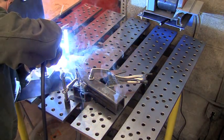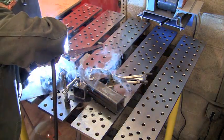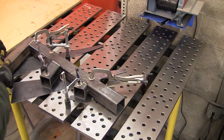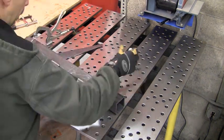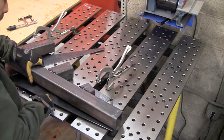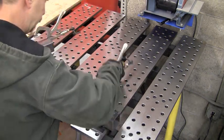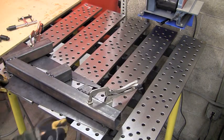We're just finishing up the last bit of welding on this side, then we're going to let it cool and flip it around, doing the same thing with the shims. This time we've got to make sure that we're shimmed up above our weld so the part is nice and flat when we weld the other side. We're flipping it over now and rearranging those shims to support the part nice and even, clamping it back up. Once that's done, we're going to flip the part one more time and just get some welds in those corners.